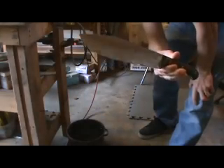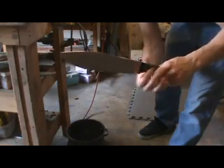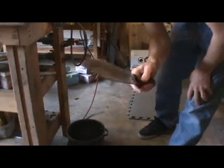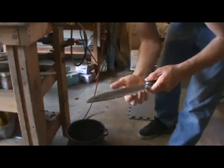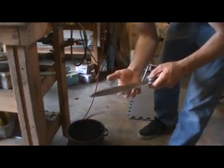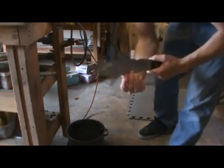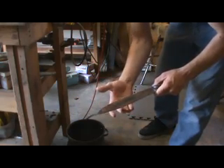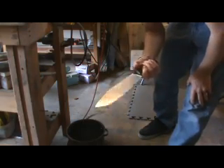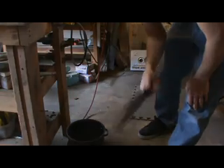You can see the difference between this knife and the other is obviously the width. The wider the blade with a full height grind, the thinner the edge is going to be — that's the problem here. I don't want to put a thick secondary bevel on these because it disguises what's going on inside the blade. If the edge chips and you add a secondary so it stops chipping, what does that say about the rest of the blade? It's usually going to be hard in there, and it might crack in half. So a small secondary with a tough edge is my goal on a full height grind machete.